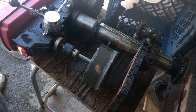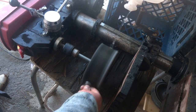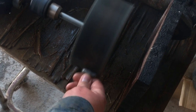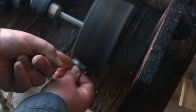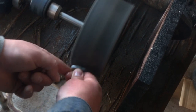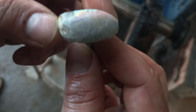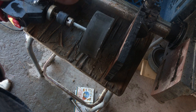Just to show you folks — I got water going on the wheel and we got a spinning wheel. It looks like a cabochon, not a very pretty one, but it definitely worked. It's sanding out all the rough spots from the hard wheel, and we did it all with a drill press, a bolt, two washers, and two nuts that cost about three bucks.